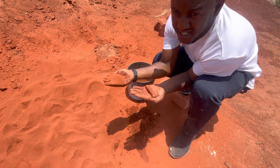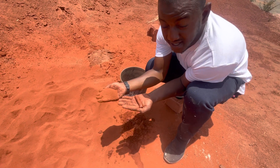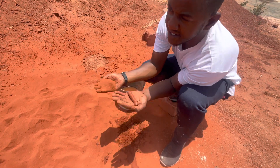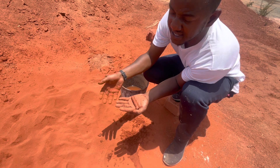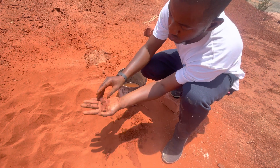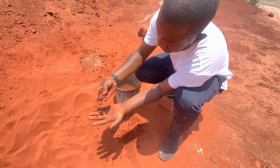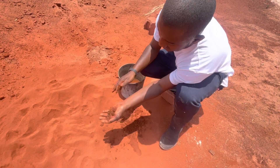But if you want to use the virgin soil without adding any sand, the bricks may look really great initially but after a while will start cracking, because it has a lot of plastic content — meaning too much clay. Clay has the characteristic of being sticky, so if I try to roll it, it breaks apart, which tells us that this soil here has lower plasticity in it.